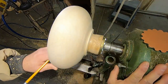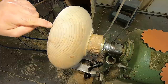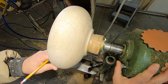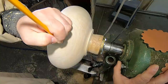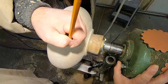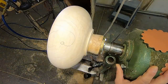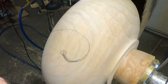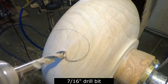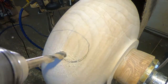When you put your J-hook on here, you don't want to put it on the end grain because once it's cut in a J shape, it won't be very stable — it's best to do it on your side grain. I use a seven-sixteenths inch drill bit and I typically like to drill the hole first and then carve out the J.